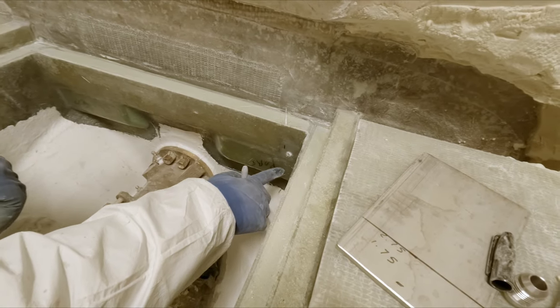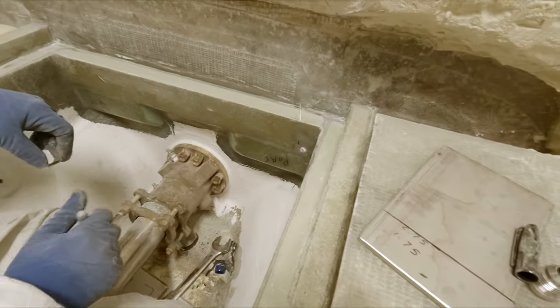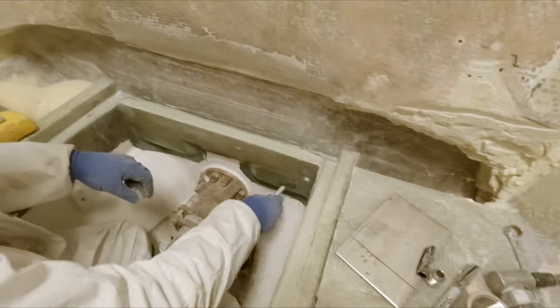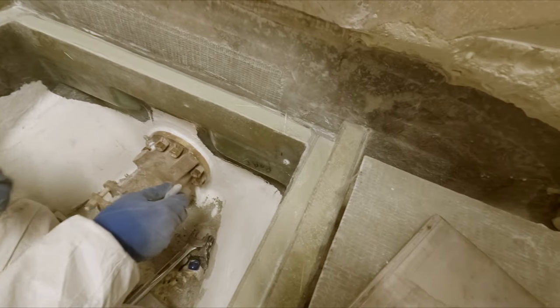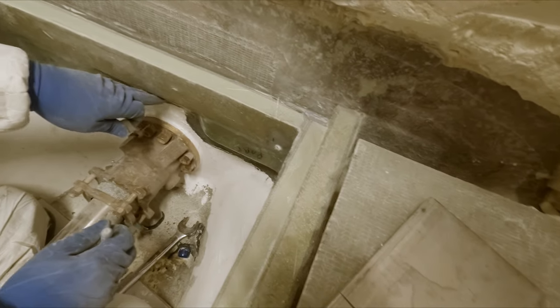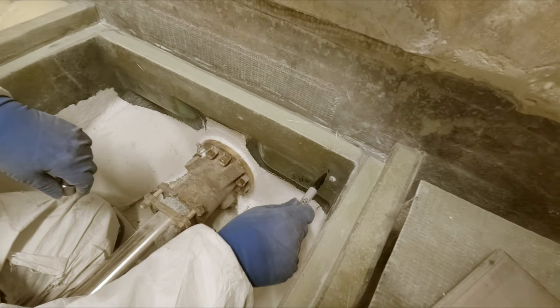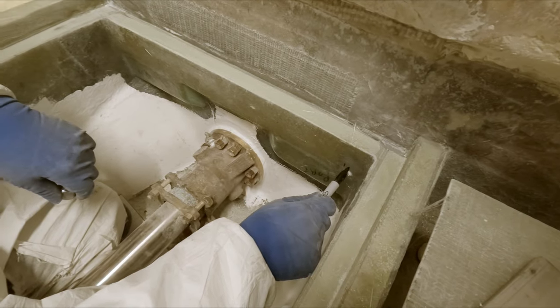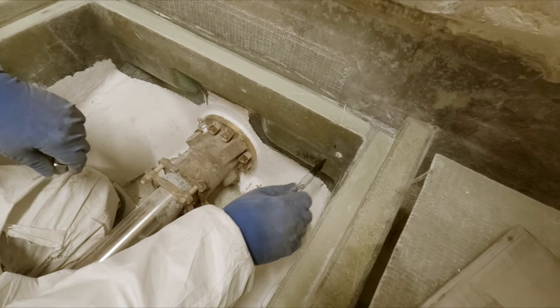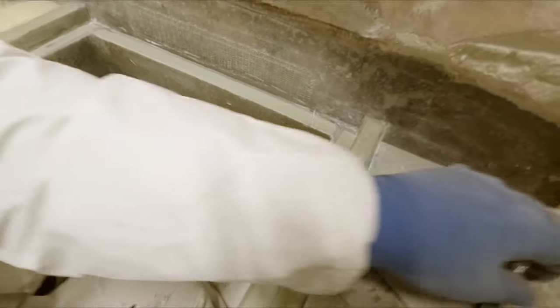This hole is about 2.5 inches off this deck that's on the other side of this bulkhead. That's why we put this piece on each side right here, was to give our plate a nice flat surface to go to. And we also knew that that was falling on this slant right here from our original holes, which were kind of, one was about right there and the other was about right there. So I think this is a good height right there.